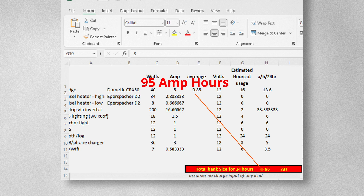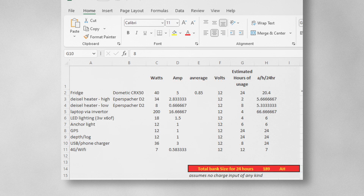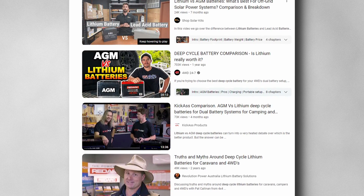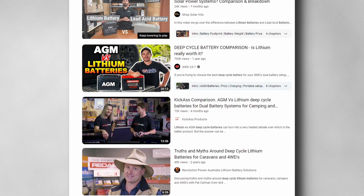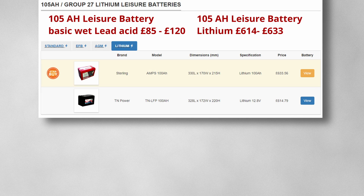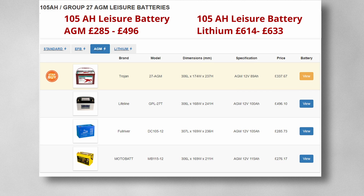So I need a capacity of 200 amp hours — what batteries should I buy? There are so many videos on the benefits of different battery types on YouTube, so I'm not going to go too deep on this subject. There's obviously a cost argument, with basic lead acid being the cheapest and lithium ferrophosphate being the most expensive. If you regularly discharge lead acid or AGM batteries below 50% depth of discharge, they won't last very long. Gel batteries fare much better but are not cheap, and still offer only around 1,000 charge cycles before they need replacing.